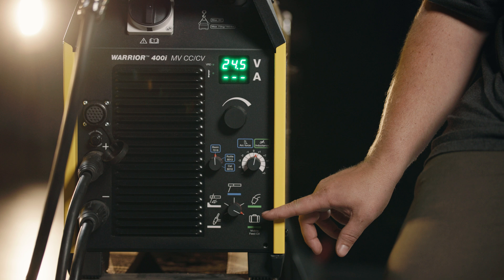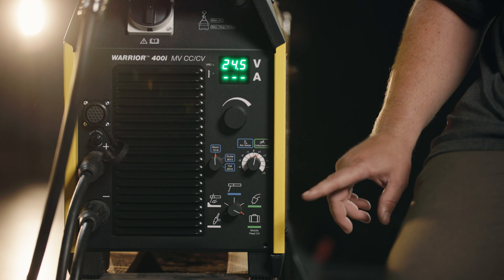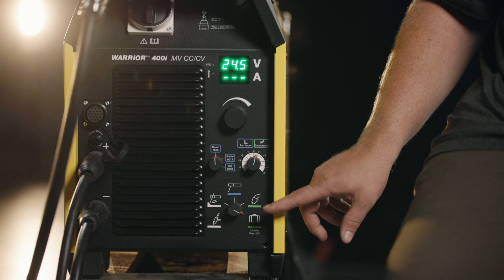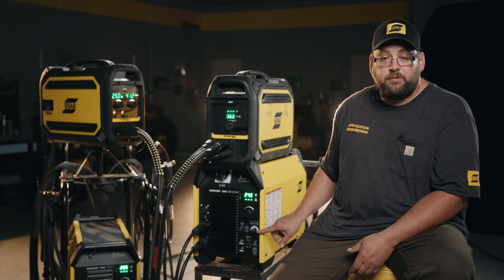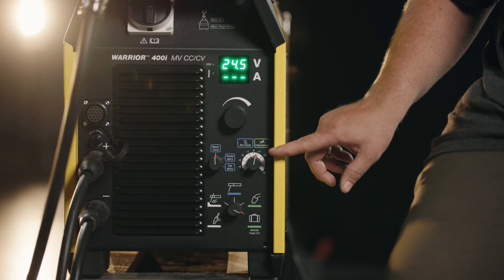The main goal is to be able to set it up without any instructions at all. The bottom control knob is your process selection. You'll notice that some of them have different color codes. These color codes interact with the switches above. In this case we're on the arc suitcase feeder mode, AVS mode, and we have green. So any of the knobs that have green — those are adjustments that we now have. In the MIG process we would have our inductance control. If we were in the shielded metal arc mode the color is blue, and now this knob would represent arc force, and the knob next to it would be a selection for better optimization for different style electrodes.